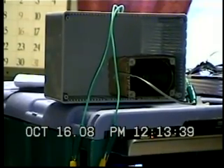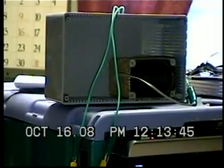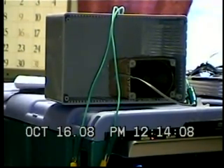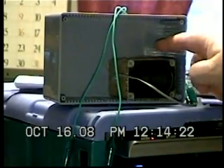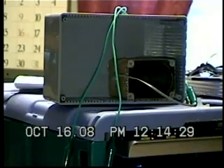Here's the speaker you'll be hearing the VLF out of. We've got quite a bit of noise right now for some pretty simple reasons — we can pull it down quite a bit. This is a Coby Tone speaker from Mouser Electronics, 2 inch by 3 inch, with a frequency range of 1,000 hertz to 20,000 hertz. Its mids and upper highs are pretty smooth and accurate, especially for a $4 tiny speaker. It's in a project box with cardboard enclosure and acoustical material behind it, so it's a good speaker for the demonstration.